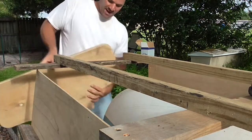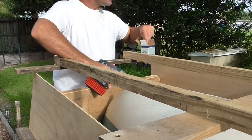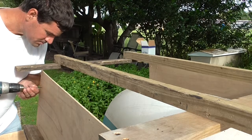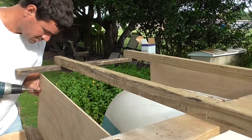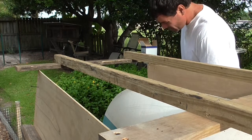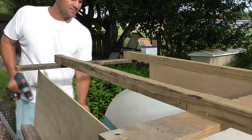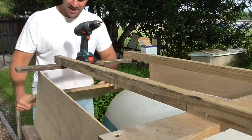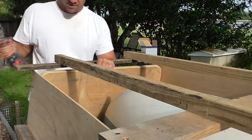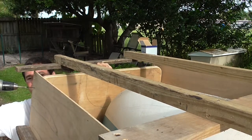So that we can run in really shallow draft - we don't have to have it as low to get back up in the skinny water. This canoe is really great, but for using my little 5 horse outboard it is frustrating because of this cut away back here. Because it is a double ended canoe, it doesn't have the properties necessary to help it stay on plane. So I am making a much broader base here, and that should help it quite a bit.